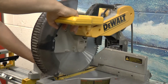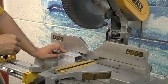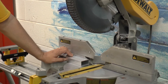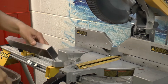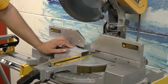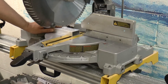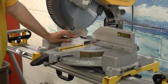The reason for waiting is that if the blade is still spinning when you lift it up, those teeth will brush along the surface of the part and sometimes knock it out of square. We've found through experience that if you just take the chop and then stop it, the parts will come out square. What I like to do is bring the saw down kind of close and start it there, so that you're not pushing a running saw all the way down. Normally I would lift it up like this, and then squeeze.